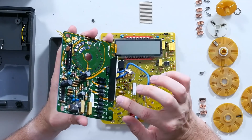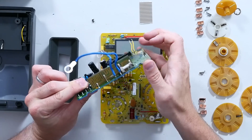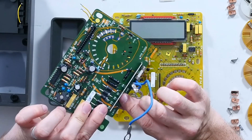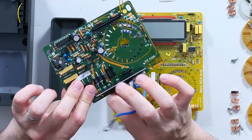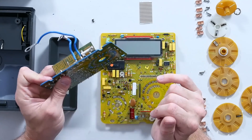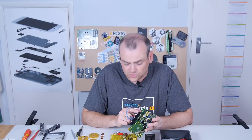The last thing I'm intrigued about is this little daughter board on the power board. If I didn't know the age of this device I'd say it was a little antenna board — it looks very similar to some of the antenna traces we've seen on Bluetooth and Wi-Fi modules. But I think this is actually a heatsink for high-current parts, because the substrate is metallic. So where you're measuring high-current power, rather than making the traces bigger you put the traces on a heatsink, essentially. I think it's aluminium.